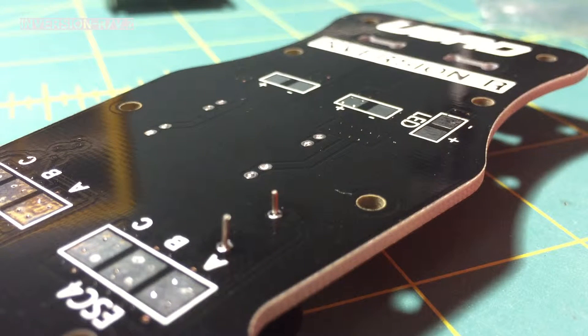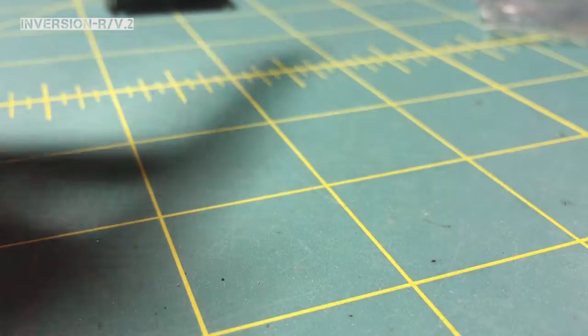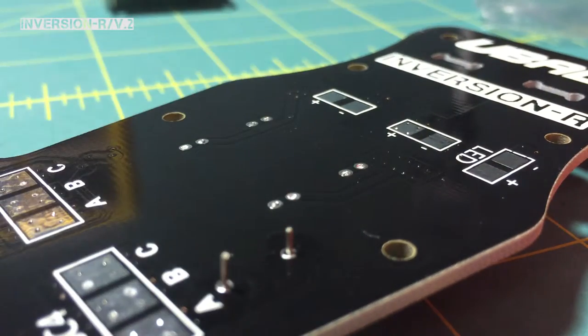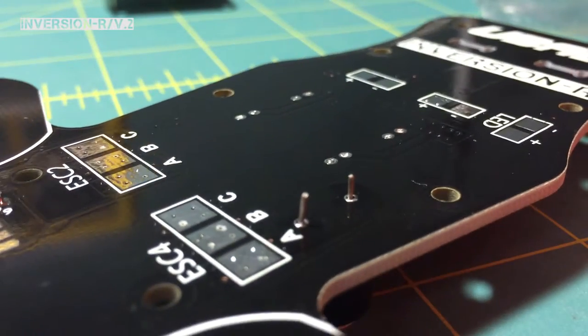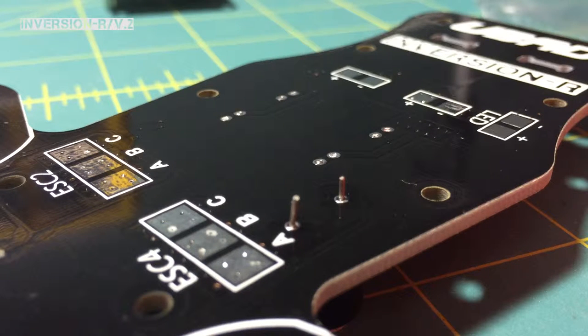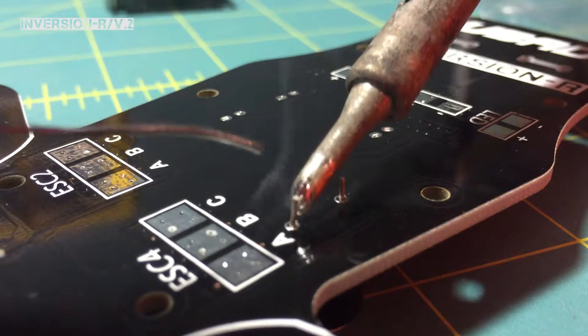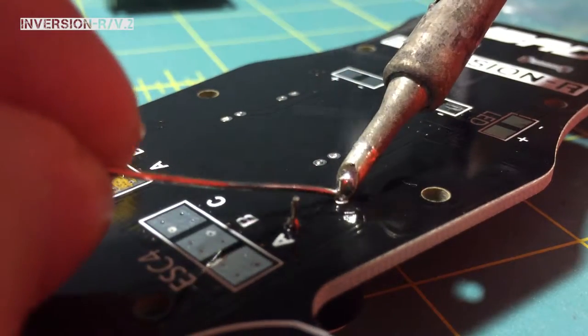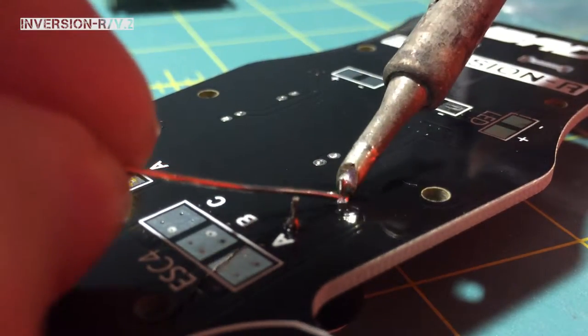Alright, so I've got that buzzer stuck through the holes — positive side on the positive side. I'm pretty sure I've got positive there. I've still got my seal on it because it's still not washed. Anyways, let me grab my soldering iron. Still set to 650. Let me tin up the tip. I'm going to go ahead and put it on here real quick — it shouldn't take but a couple seconds of it being on there. You can hear that flux sizzle.